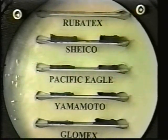We now have reached sport diving limitations of 130 feet. The Rubatex samples are still the same thickness they were at 35 feet, offering the diver proper thermal insulation throughout their dive. Again, as you can see, the imported blended neoprene have lost the majority of their thickness, almost a complete loss of thermal insulating the deeper you dive.